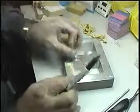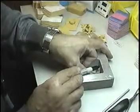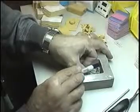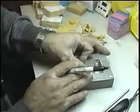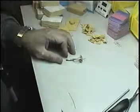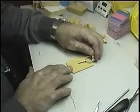We have frame number 4, which takes 10 slices of rubber, and we can see we have more than a 1/4 inch from the top of the model to the top of the frame. You can see we have a space here. That means that we could pack this mold in frame number 4, which is 10 pieces of ready cut rubber from Castaldo. So we proceed to taking the, we can see here, we balance our model.